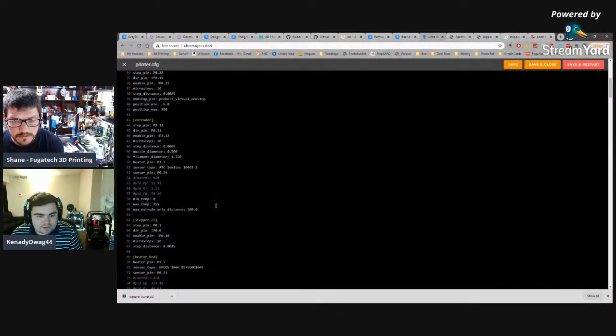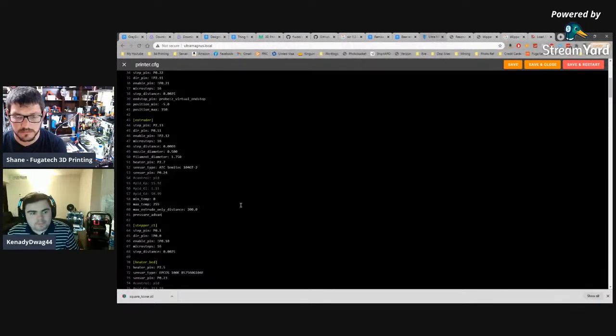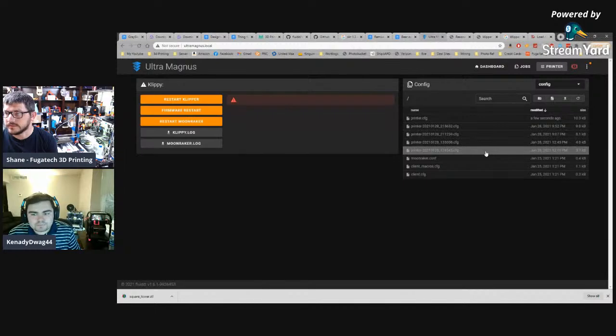And then just add it under there. Pressure underscore what? Advance. And what did you say the value was? It is 0.056. Okay, and there you go. You're pretty much done with pressure advance. You could fine tune it a little here and there, but usually it's good. Save and restart. Cool.